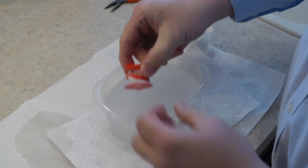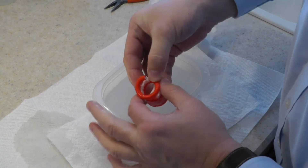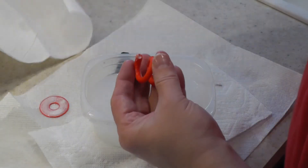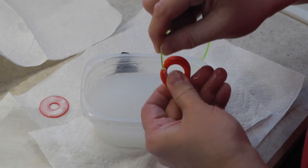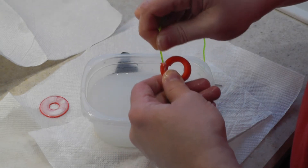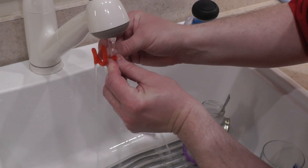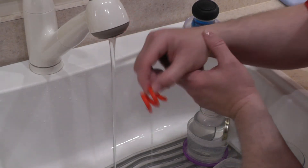After soaking it for a short time in warmer water - water the temperature you could take a bath in - the PVA is just breaking free and coming off very nicely. Even with warmer water, it took some work to ream out the inside of the coil. I had to keep putting in water and using a piece of flexible filament, digging at it and flushing water in to get those PVA supports inside to break away. But after working at it for a while, I was able to clear a path the whole way through the coil so water flows from one end to the other.